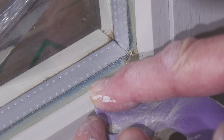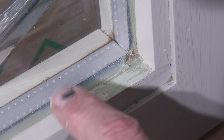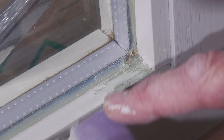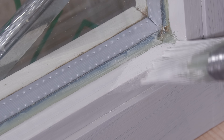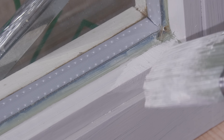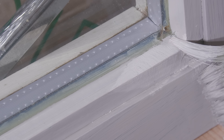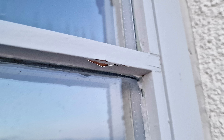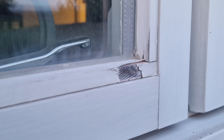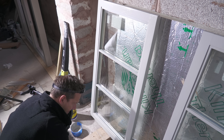In a sense I'm quite glad that I keyed the paint before I started, because it just doesn't look like that paint has attached to the gloss at all. Anyway, I'll feather that edge down and repaint it — what else can I do. With the whole window painted, I'm not going to start scratching at it with my nails to see whether it comes off. The ultimate test will be to see how well the window weathers over the next few years. It can't weather any worse than the other ones I've had installed, which have failed — one literally failed about three months after installing. Look how the sun has completely rotted away the CT1 sealant. I won't be using that again. But in the meantime what could I do but press on with the final coat.